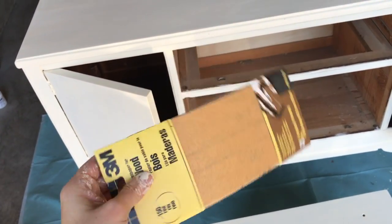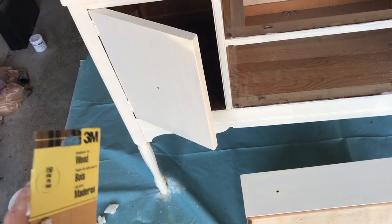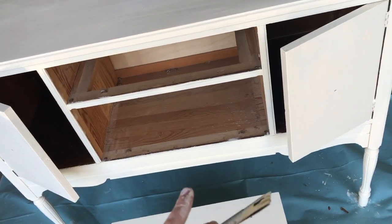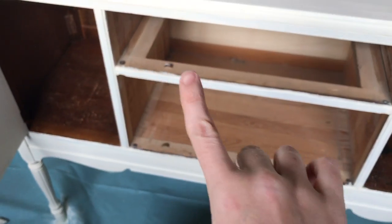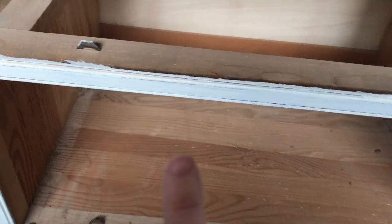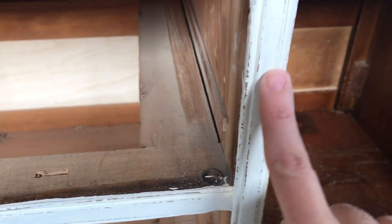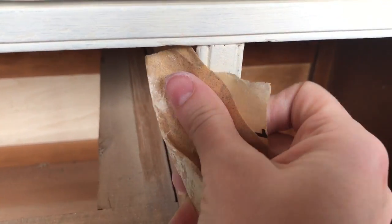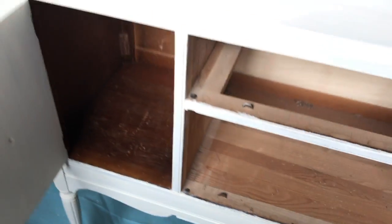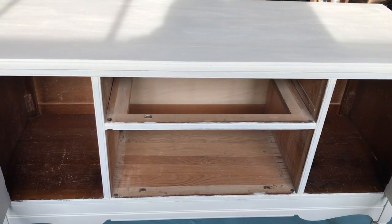Now it's time to get the sandpaper going. I'm going to distress the edges a little bit to give it an aged look, then apply the wax. I'm doing the sanding and distressing — giving it a worn, faded look. You can see I've done a little bit here and it brings out the details in the wood, which I really like. You just take a piece of fine sandpaper, go over the edges, and it cuts a little off, adds character, brings out detail, and makes it look broken in rather than freshly painted.